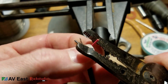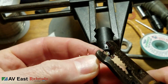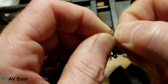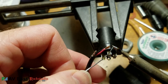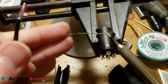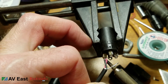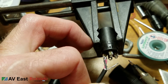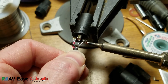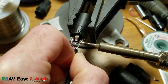I typically strip back about three-quarters of an inch from the end of the cable to make an XLR. Trim back the shielding foil, trim back any string or filler. Strip back about an eighth of an inch of each conductor and tin those as well. Remember, this is a very atypical cable — we're going to twist both conductors together and solder them into pin 2. When you're ready to solder, wet the tip of the iron, reheat the cup and liquefy the solder before inserting the cable, then steadily hold the cable until the solder cools. Now do the same for the drain wire. Let's see if you remember to slide the connector cover over the cable before you solder — a little test!